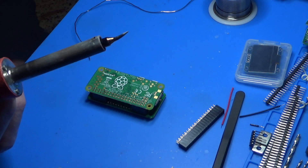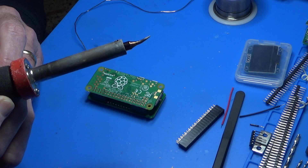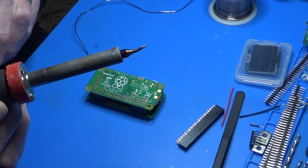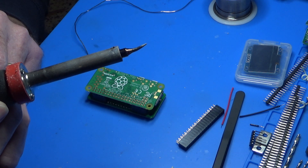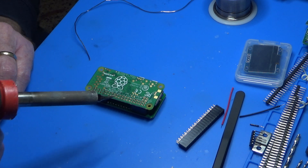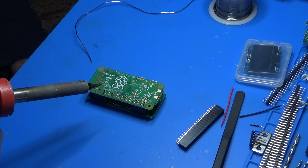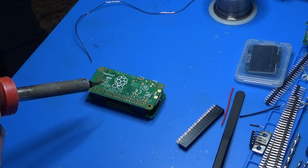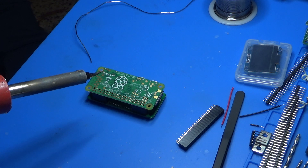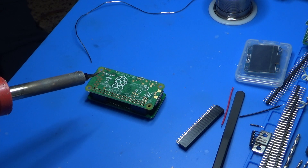Getting back to soldering, you'll notice I have a nice little curved tip — it's quite a fine point. The reason I use that is because I can get the heat directly into the space without applying heat to any other components. There's a lot of bits on this board, so you don't want to apply heat for long. The trick with soldering these SMT — surface mount — boards is a good amount of heat and be fast. You need to be quick. You can't hold the iron on there for very long, because you'll start to cook other stuff and could have components on the opposite side of the board just drop off.